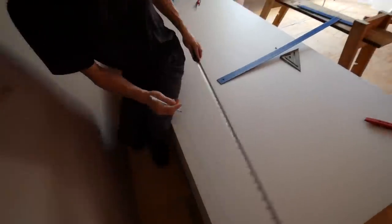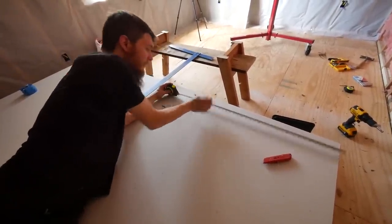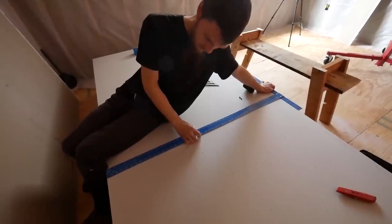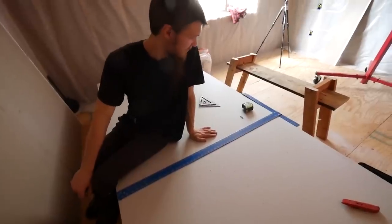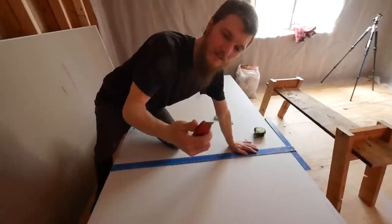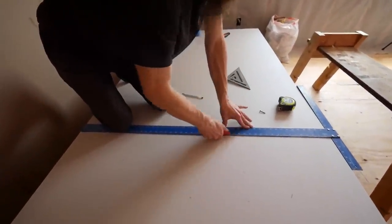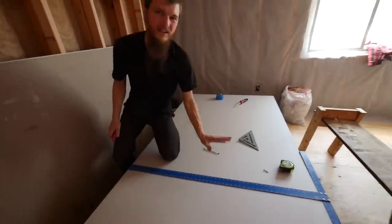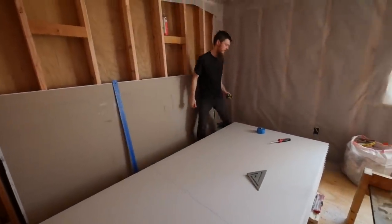My first one is going to be 34 inches. If you're doing drywall, buy a drywall square like this because these are handy — they're also called T-squares. We're just going to use a regular knife like a box cutter and score it. You don't have to go Hulk on this — you just want to cut the paper and a little bit into the drywall. I usually go two times through it for a nice clean break.